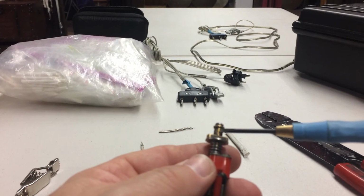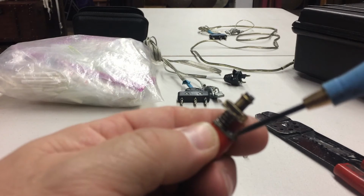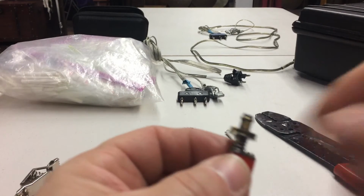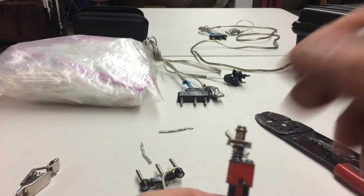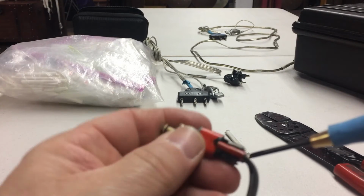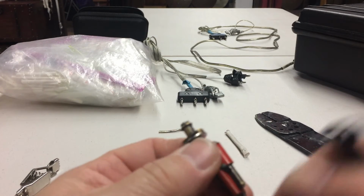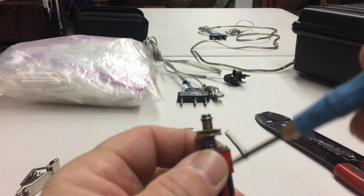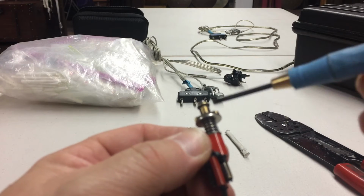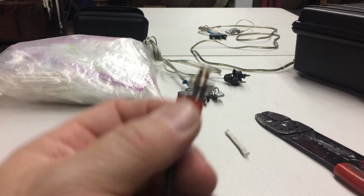First off, this is the B. This is the one that sits on the little plate on the inside of the socket. Make sure it's nice and tight. This is the C side right there. Make sure that's nice and tight. That's in contact with the top of the socket bracket. Where the wire comes in, it comes in these little channels here, up and loop through, so it doesn't matter which one goes where. The C line's going to go on this one here that's in line with this small screw here. The B side's going to come in and be in line with this one. And again, all you need to do is push it through, crank the screw tight, and then it'll pierce the insulation and you've got a good connection.